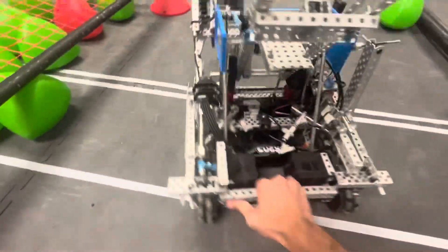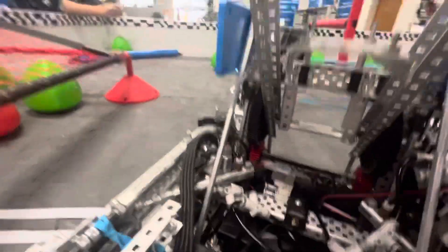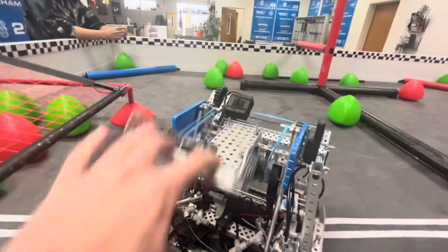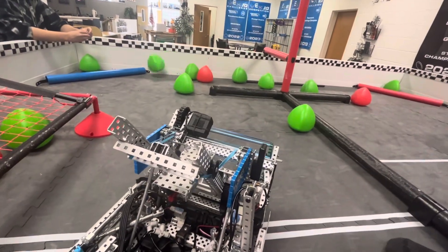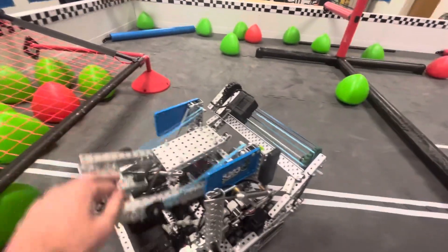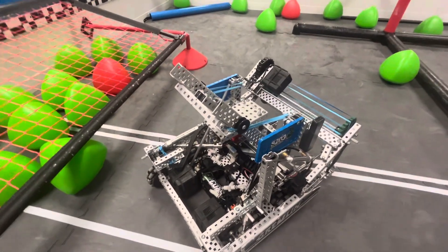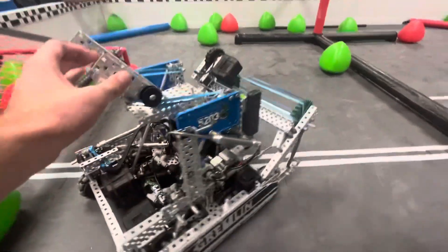It's probably one of the fastest shooters at mall. We run a 36-tooth slip gear direct to the 100 RPM motor to an 84-tooth gear, and that 84-tooth gear is screwed to the slapper mechanism. We have a platform on top so it just shoots very nicely when we want to go over. That helps us load really fast because we just have to set the acorns onto the platform. We ran the slapper at about 85% speed to shoot over in about 30 seconds.